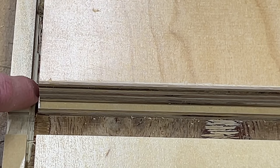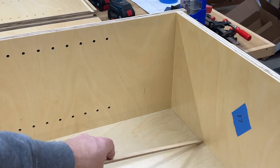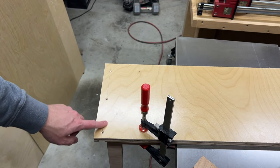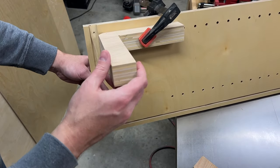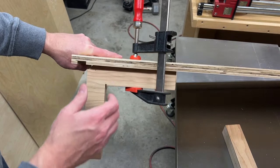Hopefully that helps you not make the same mistake I did. After that slight adjustment things look a lot better — the gap is mostly closed up and whatever little bit's left will close up all the way when I drive screws in from the back. I've pre-drilled for screws on each side, top and bottom, and I'm also going to use these clamping squares that I made a while back to hold everything square while I get the screws in and let the glue set up a little bit.